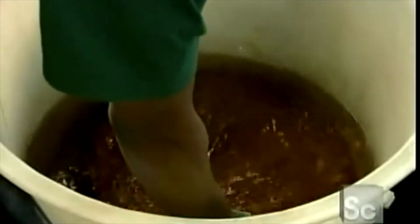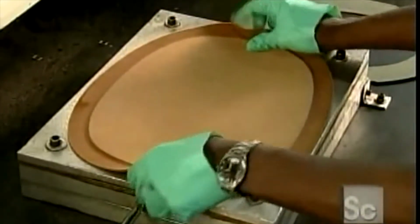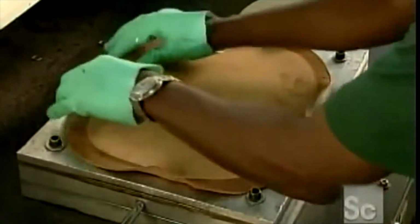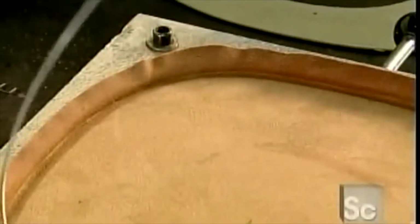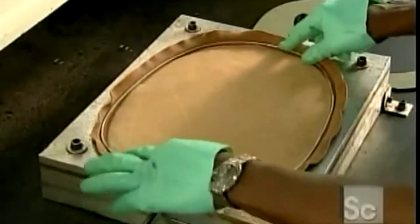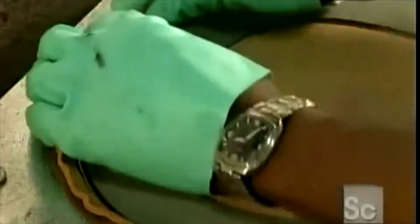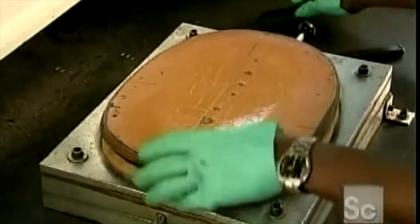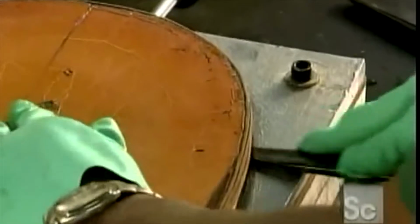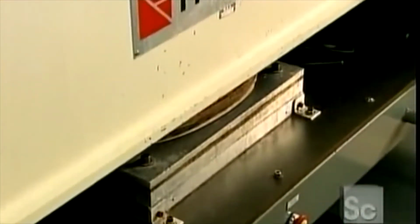They wet the brim piece several times to make it more pliable. Then they stamp it with a design used by this company since 1846. But first, a worker inserts a wire that will give the brim some structural support. Then a temporary plastic cover and a lid to ensure an even spread of pressure across the brim. She stuffs the edges of the leather inside before the press applies 10 tons of force to imprint the design.